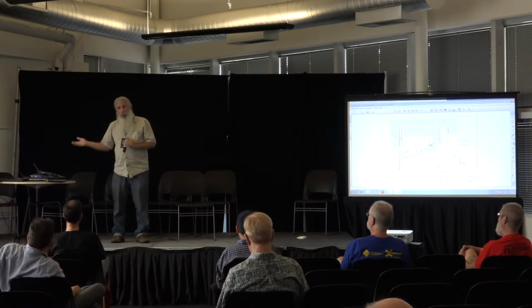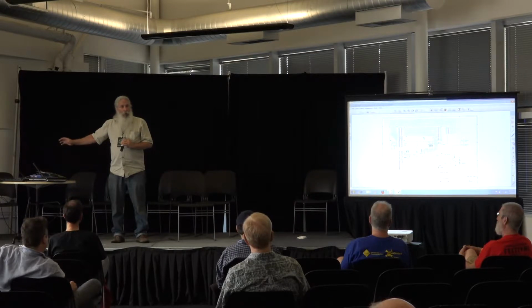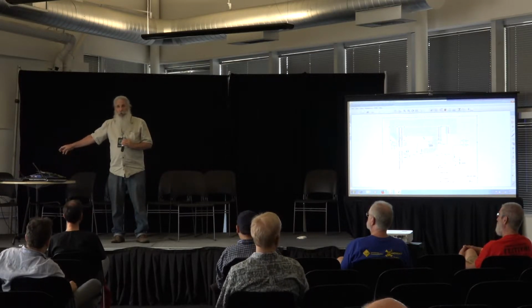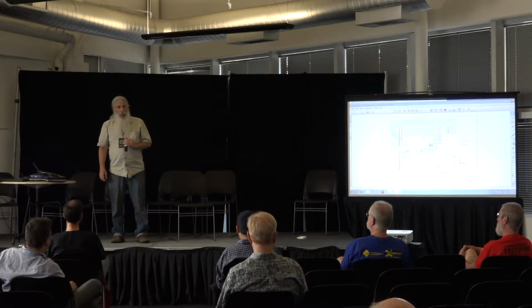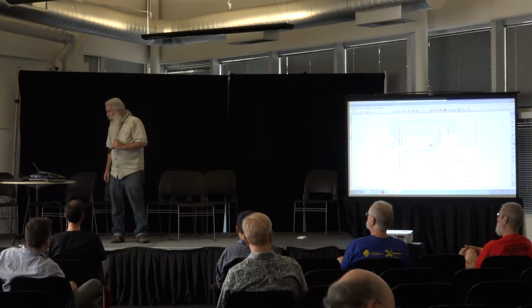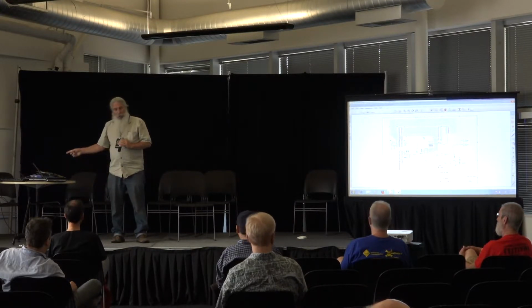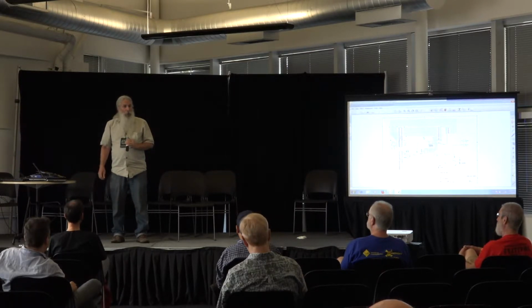And then I go on, I do a test of the display and the keyboard, and then the actual ROMs themselves. I do a CRC check of each of the ROMs inside of each of the 6530 positions, and that's where the code is. Also, there's RAM inside of each of the 6530s. I test those as well.